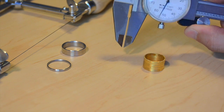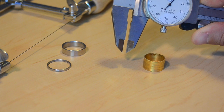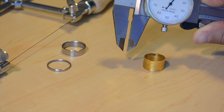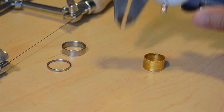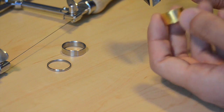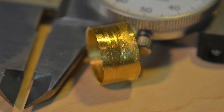The first step is cutting the gold ring into two parts. I measured out the width of the smaller ring plus half a millimeter extra, and I used the calipers to scribe it onto the gold. Unfortunately, I then proceeded to do this pretty much entirely off frame, so I'm just going to skip to the final product.